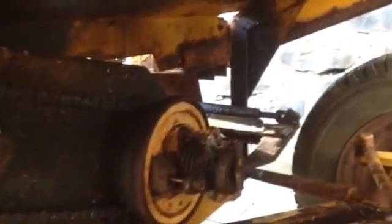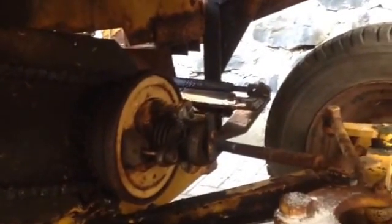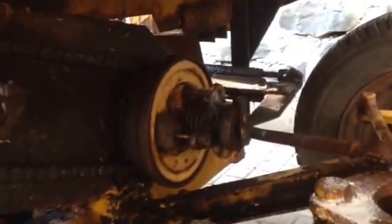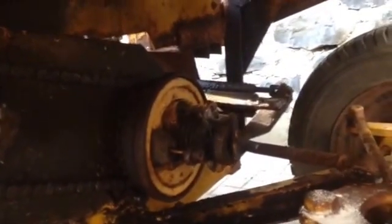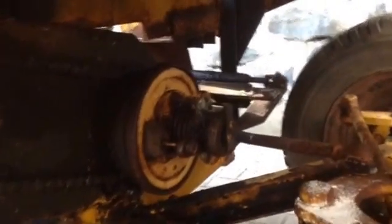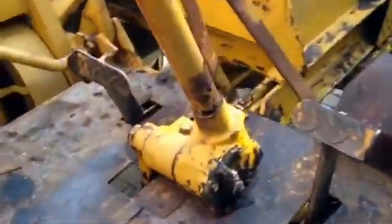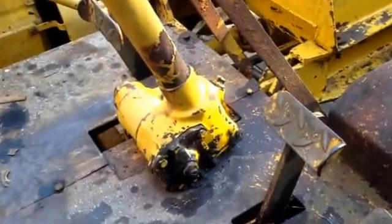Okay, it's chain drive, and it's got that shoe clutch that we're all fairly familiar with. That can stick, so if you find that stuck, give it a slap with a hammer around the rim, just gently, or you'll crack it, but that should release the clutch shoes. And if you find the clutch is slipping, it's worth oiling all that mechanism there, because quite often it holds the clutch from fully re-engaging. The smaller dumpers of these have problems with the steering box. This has got a nice solid steering box on it. It's from the bigger dumper.